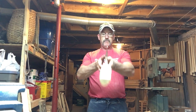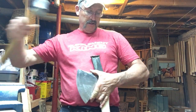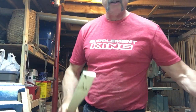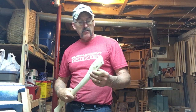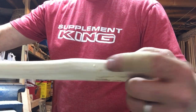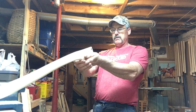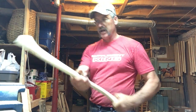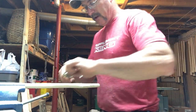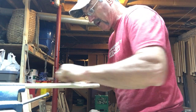All we need to do now is just keep going back and forth until it's done. We know it's going to come out fairly slick. Look at it again — you can see where it's dragging on this side, pinching a little bit here. And this is the curl that I told you about that we want to take off. Same thing again — I'm going to clean that curl right off so it's a nice smooth transition. I'll take my file and smooth it out.